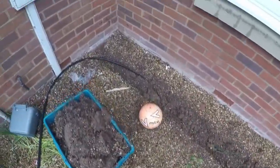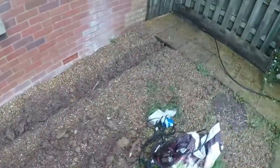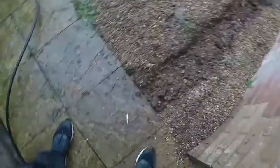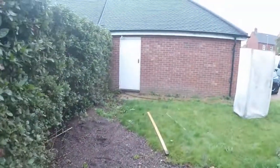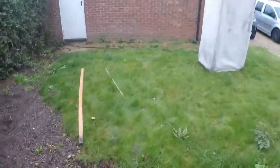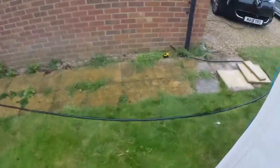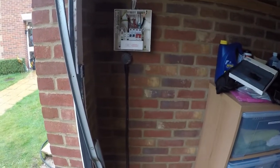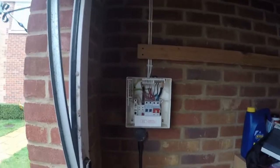Alright, we're burying the armoured. Like I said before, we haven't gone too deep because they are having all of this pulled up again and redone. We've gone deep enough — it comes under these two slabs, pops out there, clips along. You can see it's just running along in there. We've already got it through the wall, obviously we're going to have to lose some of that slack. Measured that out so it'll just come up to the right-hand side of the board.